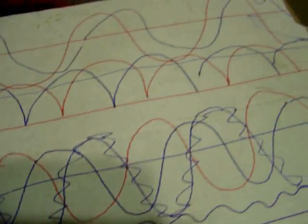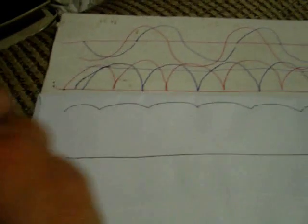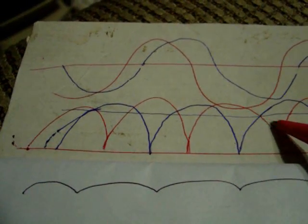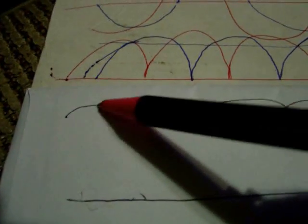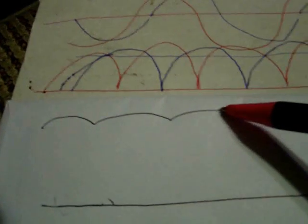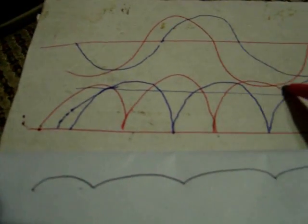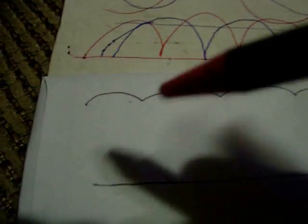So these are almost like three-phase, but not quite. I guess you'd call it bi-phase or double-phase. What I didn't show you was that this line right here is above your battery voltage. If this is zero, you wind up with a pulsed or a slight ripple in your DC that's above — rather than going to zero and then charging, zero and then charging — you wind up with a ripple above your battery voltage.